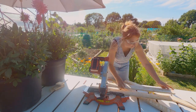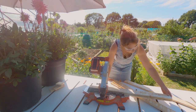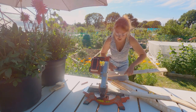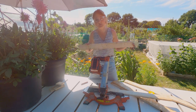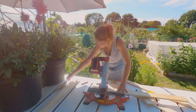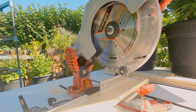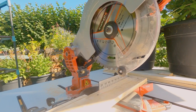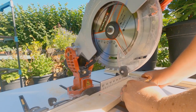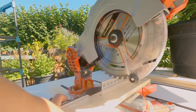If you don't want to measure each one out, you can place your first cut piece, line it up at the end, and draw a pencil mark down it. That means even if the first one was slightly out, they're all going to be the same, which is what you want. The other great thing about the mitre saw is that it comes with a laser line, so there's no need to worry about where your cut is going to be.